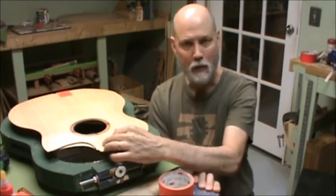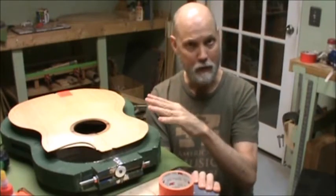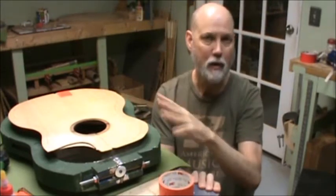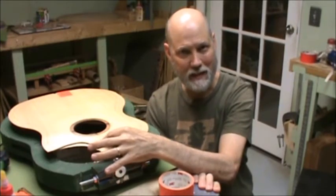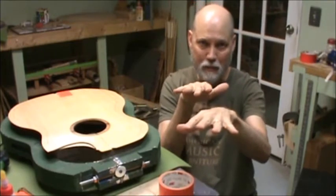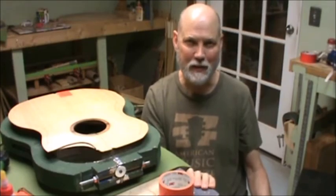It's enough for the tape to be able to stick to the top without pulling the fibers out. The tip is these two little pins. I'm doing all this obviously before it's glued up, before I spread the glue out. What I'm going to do next is pull the top off, spread the glue, and then put everything together, put the tape on it for real, and clamp it up. These two little pins — simple little thing hidden under the fingerboard — they really can keep that scooting. Every now and then it will move just a little bit, and a little bit makes a big problem. Be happy building guitars.